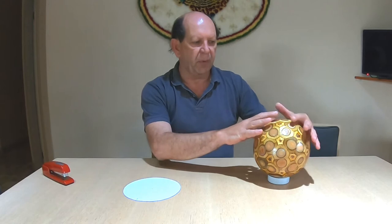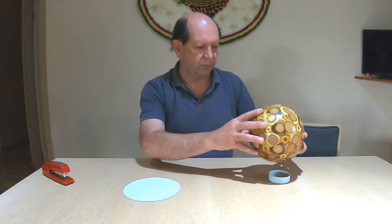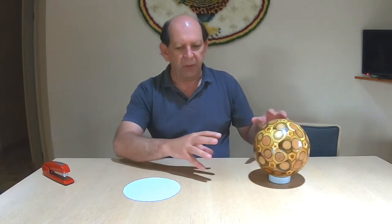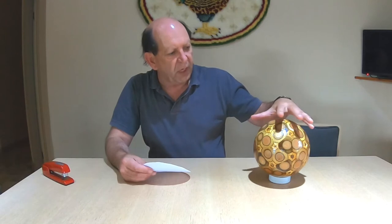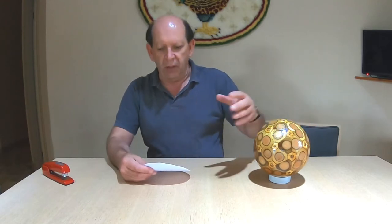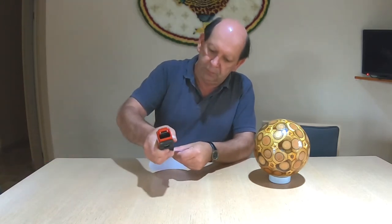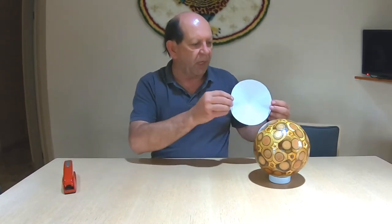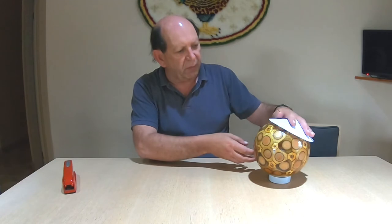One of the challenges with this project was always going to be how to round off the multi-sided shape into a sphere, without using a woodturning lathe, which we didn't have. We looked at a couple of different strategies. One idea we came up with was that if we could sand it down with a cone shape, it would eventually force it to become round — a little bit like this piece of paper. So if we had sandpaper in this shape and we could spin it and work the ball, it would eventually become round.